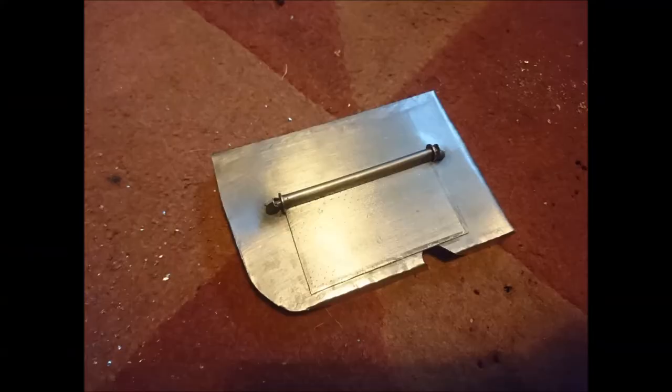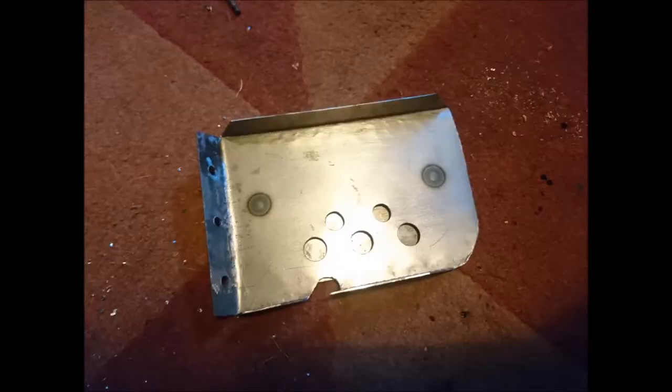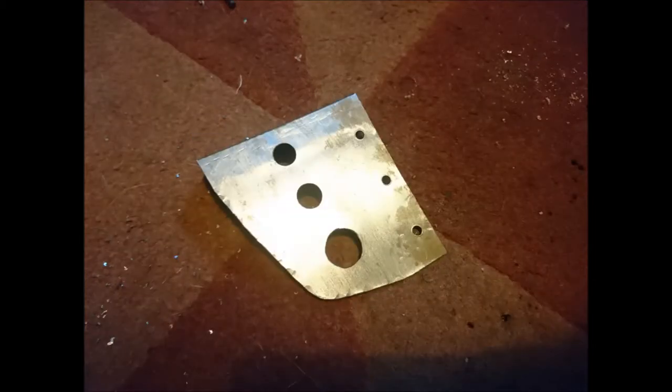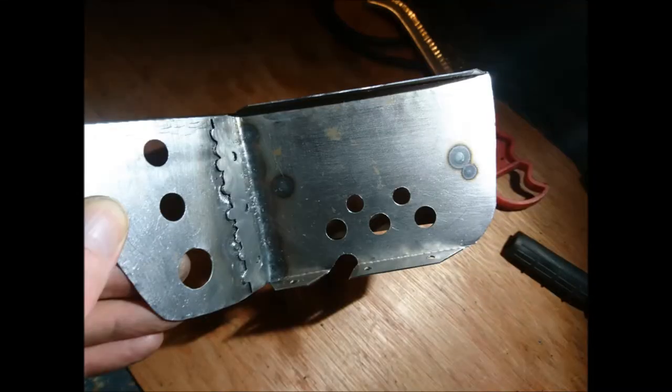Here are a few shots of basically what it looks like. After the fact I decided I would drill a few more holes, bringing the total up to five, to allow oil to come through more easily. This is basically a rear shot — you can see that the welds are very neat. The rest of the welds holding the actual baffle assembly to the sump are not as neat, simply because the sump was 47 years old and there was a bit of oil impregnated into the metal.